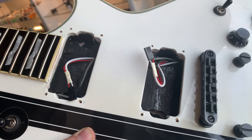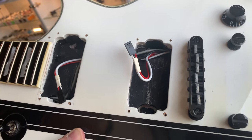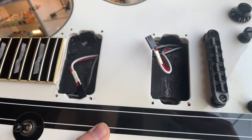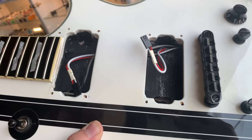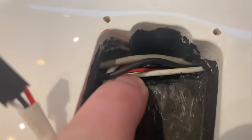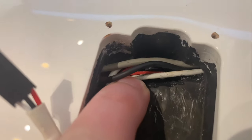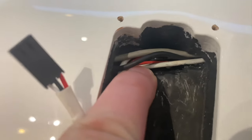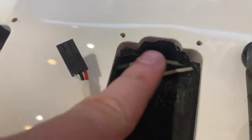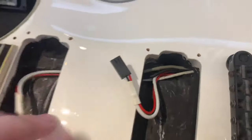You've seen the ESP, now I'm showing you the LTD. Tell me, are those the same guitars? I'm pretty sure that the cost and time cutting didn't end with the cavities as well. I mean, look at the routing for the cables of the pickups. It's just chiseled. They CNC'd the body and then chiseled away the rest of it. It looks like somebody gave me a sharp instrument and said, George, make some way for the cables.